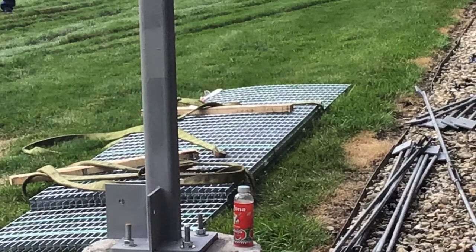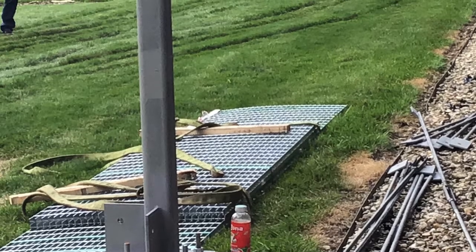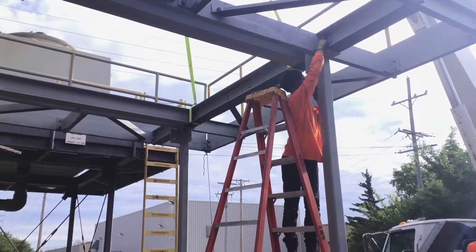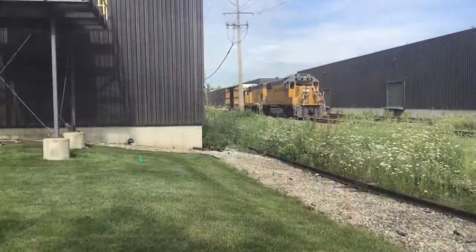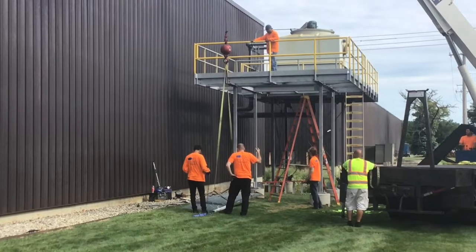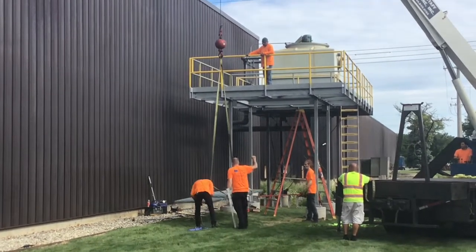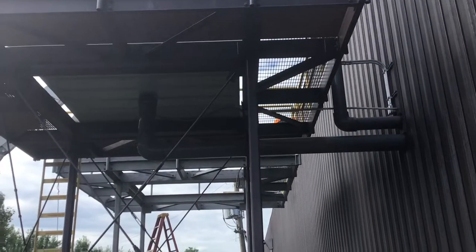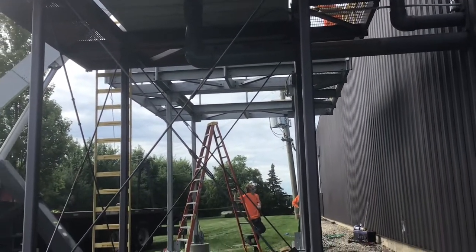Also notice on those pillars, those were poured about 2 weeks ago and needed to dry. And of course, they're showing the top 18, 20 inches above the ground, but they go about 4 to 6 feet deep into the ground. And that all depends on your soil sampling and the testing done prior.